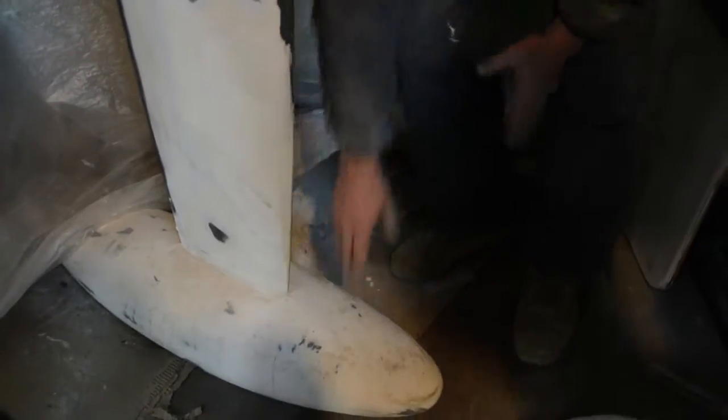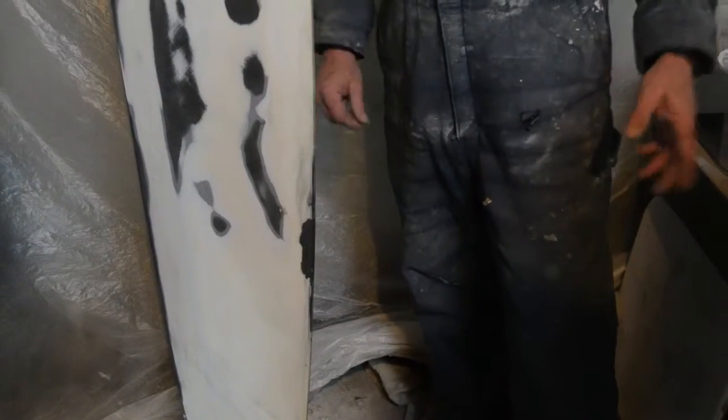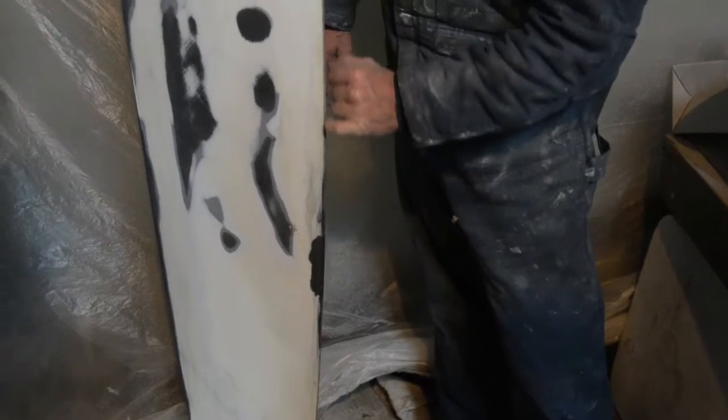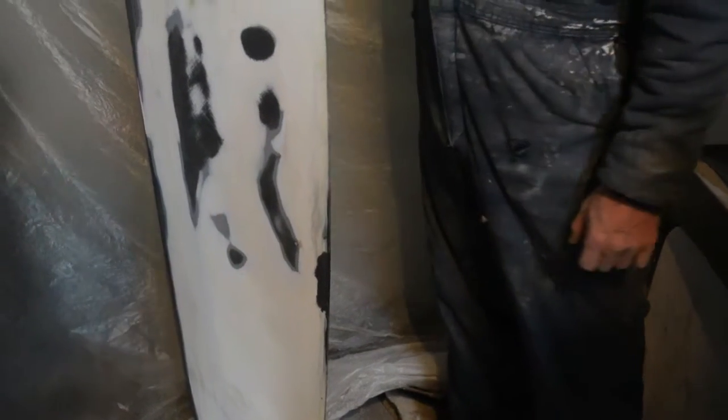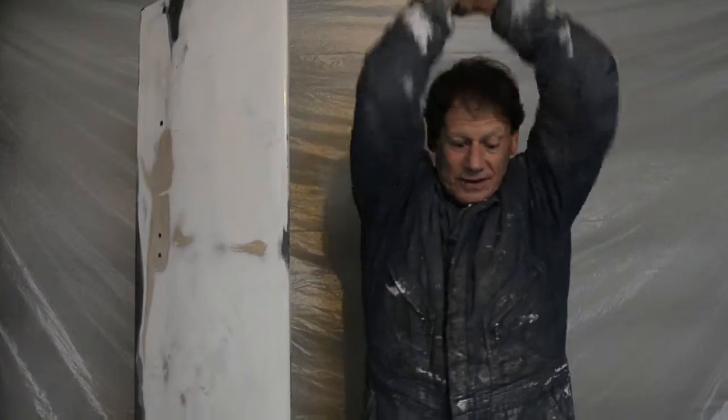One of the problems with a bulb that extends beyond the leading edge is kelp and eelgrass. So this little groove, they've got a rod that runs through a tube up here, and a razor blade sits on that thing. And if they think they've run over it, a guy goes over and grabs that rod and rams it up and down and slices the spaghetti off the front.